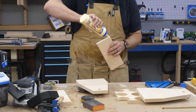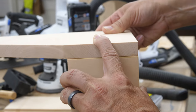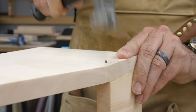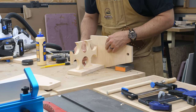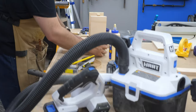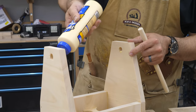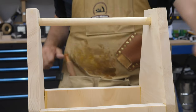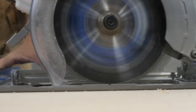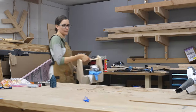Then it was time to assemble everything. I used some Titebond II for glue and held it all together with some brad nails. After I had two sides together I simply glued my divider into place — that fit pretty well. Then I glued the rest of the pieces together, added some glue to the holes and slid in the dowel rod. Looking pretty good. Next I grabbed my thin plywood for the bottom, cut it to size with the circular saw, glued it into the rabbets, added a few nails, and that was that.